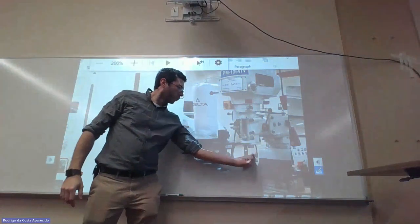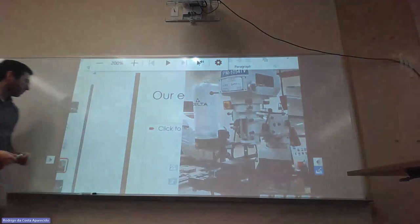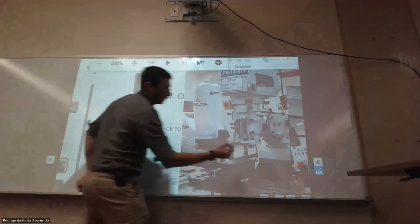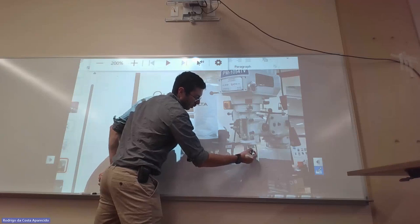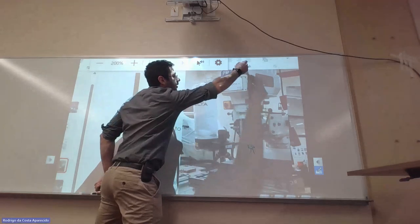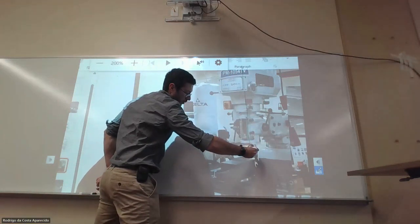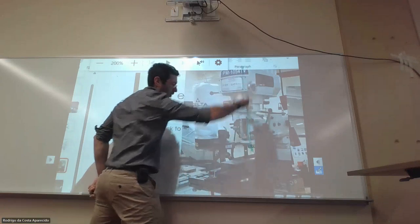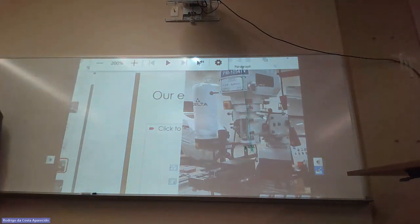So see, your tool holder is going to go in there. And there's a female taper in there that matches. So inside of this guy here, you have the female of that taper. And then the tool holder has the taper here. So when the draw bar comes from all the way up here, screws it in, it pulls it together. And then it just locks in place, right?